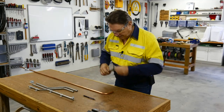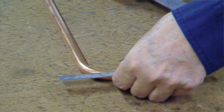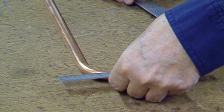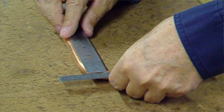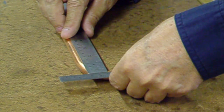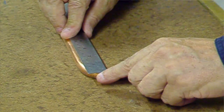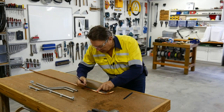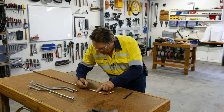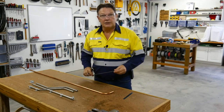Taking your 6 inch ruler and your 12 inch ruler, simply line your 6 inch ruler up with the shiny line on this part of the tube, and then line up your 12 inch ruler with the shiny line on the other. When the rulers touch, that becomes the apex of your joint and you can simply measure from there — say 160, make it 200 — and place your mark on the tube. And it's as simple as that.